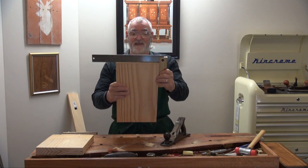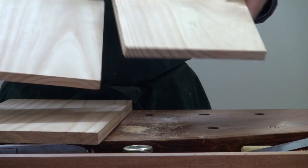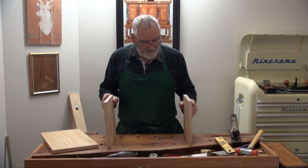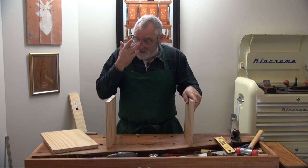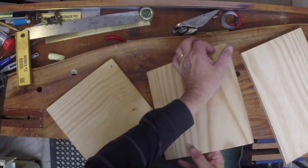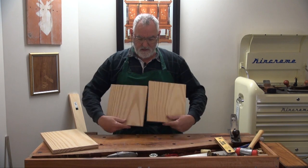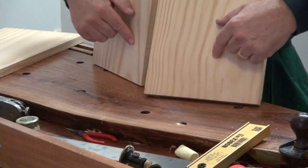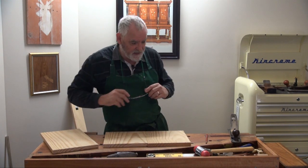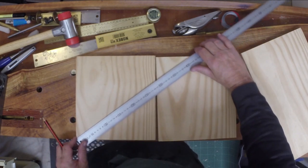These are the top and the two leg pieces. I don't want two flat pieces sitting on the floor because it's very hard — especially if you've got tiles or slate — to get long flat edges to sit straight. I'm going to cut a curve out on both legs so we only have floor contact with a couple of inches on each end. Both of those crown cuts pointing upwards.